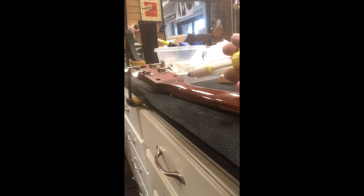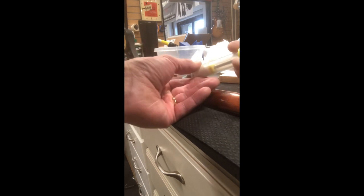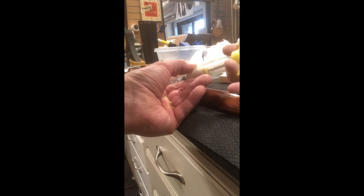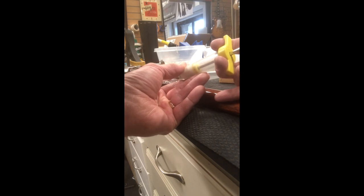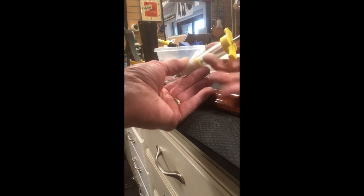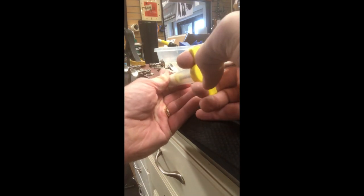I may need to get this to open up a little more — not much. Going in from the side, cross-grain. There we go, got glue coming out. Now going into this secondary crack — I can see glue coming out. Sometimes you've got quite a bit of pressure on the syringe. Almost bent it. There you can see glue coming out down here. I'm going to put one more injection here at the tip and then we're going to start clamping it up.